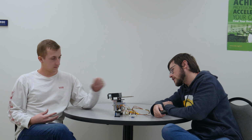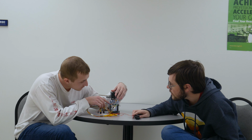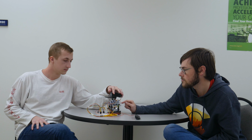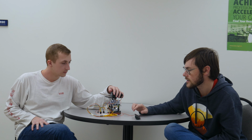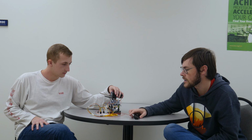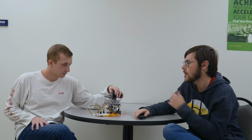Now, of course, the way that we communicate with the microcontroller, like we said before, is with I2C. And there are actually pins dedicated on the microcontroller to I2C, being PC8 and PC9. Those 2 are hooked directly into this controller. And when we do different tilting motions with this, it will show on our gimbal.